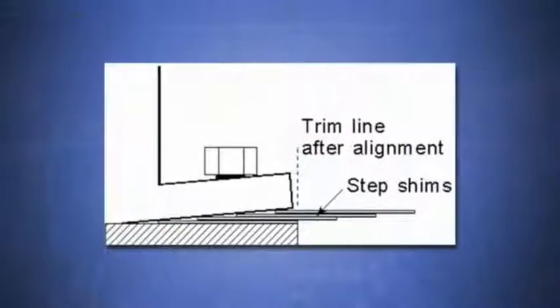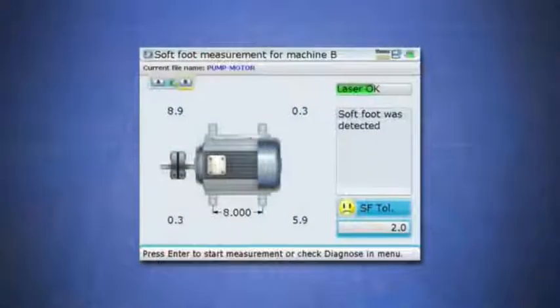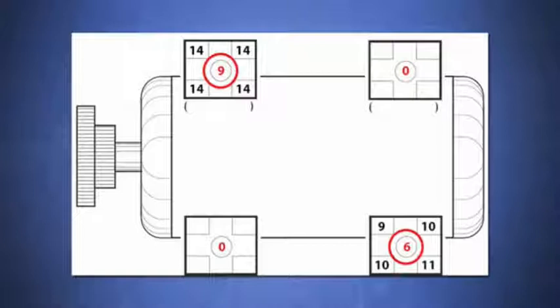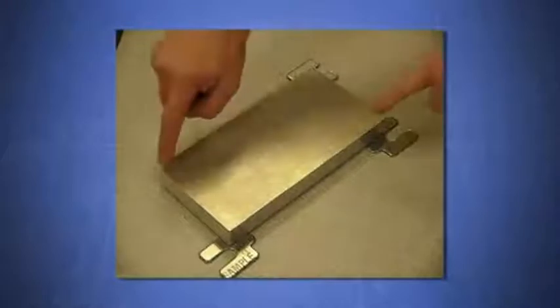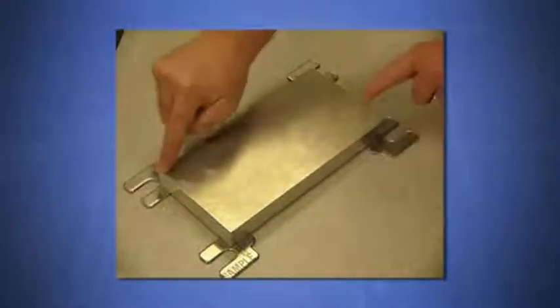While most gaps under a foot can be filled with pre-cut shims, a foot that is angled or bent requires a step shim to fill in the gaps. In this example softfoot measurement on a motor, all four feet are measured and the values on the opposite corners are higher than two mils, indicating those two feet are causing a softfoot. One foot is loosened and a feeler gauge measures the exact gap under the four corners. The feeler gauge readings show more gap in the outer corners — this is an example of a rocking softfoot. What is actually happening is that the machine rocks to the side to create a gap when the feet are tightened. The solution is to simply shim one foot to get rid of the gap.